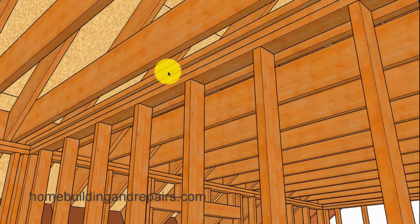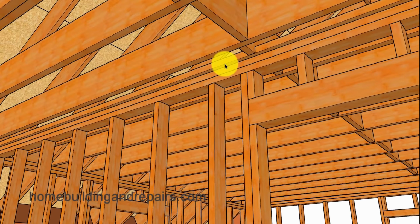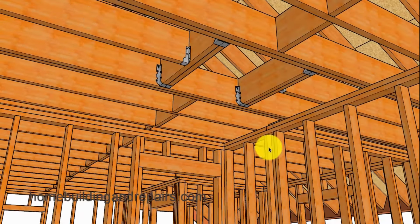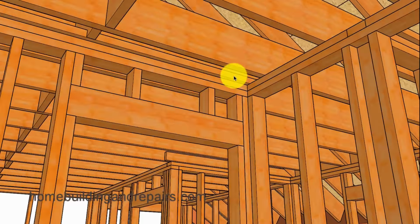And again, here we have our ceiling backing, a flat 2x6, and we notched our joist block over it. You can always take the backing to the block on each side and then avoid notching it. And again, I don't think there's really going to be a big difference there. I know a lot of people ask me, hey, what would you do? And to be honest with you, I like this connection here. And of course, our access hole here with our hangers.